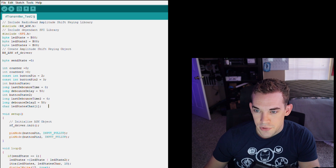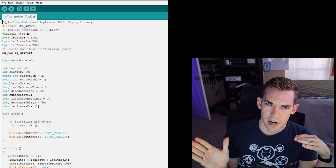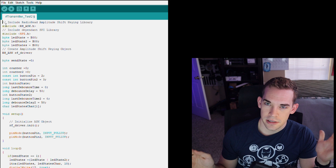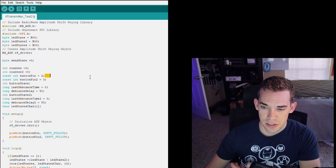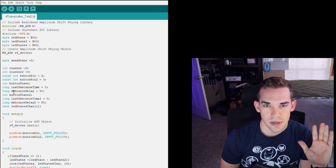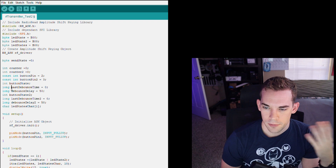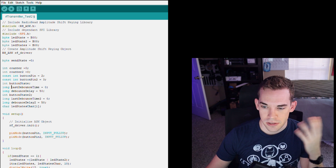Now getting to the portion of the video where I'm sure I'm going to have the best audience retention — please hang in there, it's not too bad. This is obviously the transmitter. I went through several iterations due to the problems I mentioned earlier. There was a VirtualWire library which changed over to the RadioHead library, so I had to switch back and forth and not all functions are the same. I initialize a couple counters for each of the functions — the button state (the current reading from that input pin), the last debounce time (the last time the button was pushed), and a debounce delay to stop any flickering on the output. I have both of these as long variables, which means they're extended size variables for number storage. I repeat that for button two.